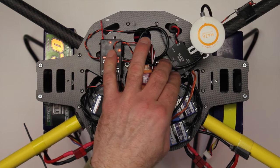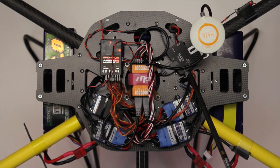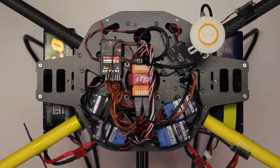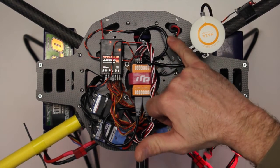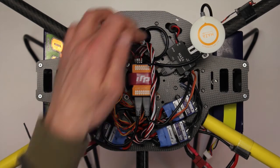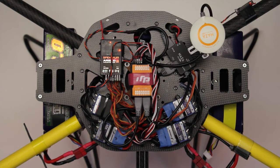The next module is the PMU, which is over here on the side. It has five wires coming out of it, which made it a little more difficult to locate because each wire has a strain relief handle built into it. You can't just pack it in a corner because the wire needs room to go out and around. Take that into account when planning your layout — you have to give the PMU some free space around it when choosing where to mount it.